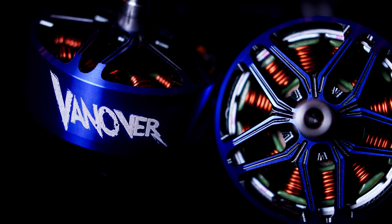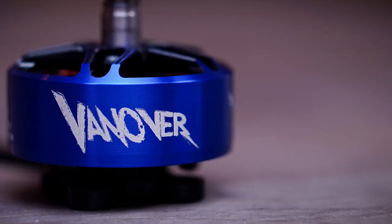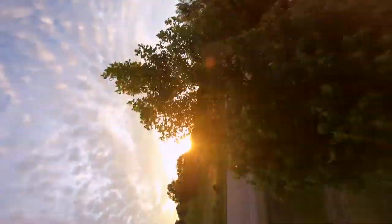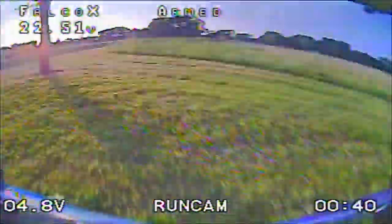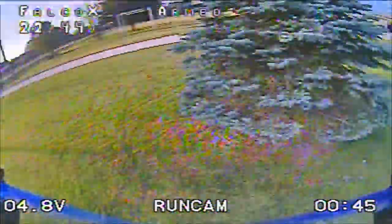It is navy blue with a beautiful navy blue and black base, and it has five spokes instead of three spokes to stand out a little more. This motor is a 2207.5 in terms of stator size — I went with 2207.5 because I found the best top-end power but also the best efficiency. It's an 1860kv motor, mainly for 6S, though I've also been running it on 5S. I tried as high as 2900kv and as low as 1700kv, and found 1860kv was best for 6S across racing, freestyle, and cinematic flying.